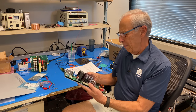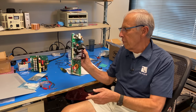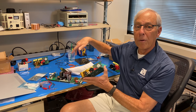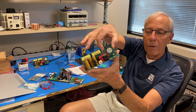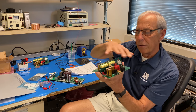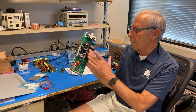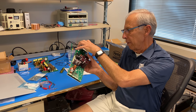So here is — which one is this? This is probably from an M1200 or 700, I don't remember which one. I'm guessing this is an M1200. So this is a complete amplifier, well, complete without the input stage. You can see the vacuum tube socket — that's where the vacuum tube would come out. Here's the back of the amplifier, and then you can see all the capacitors we line up for the power supply. This is a completely separate input stage and this is where a lot of the magic happens. From there she goes into this module — and this module from ICE is a 1200-watt into 4-ohm amplifier where the power supply and everything is contained.